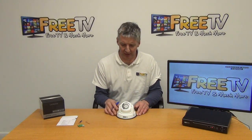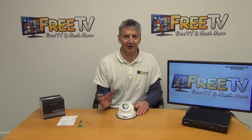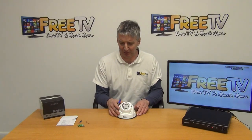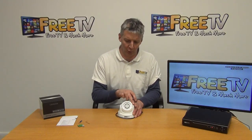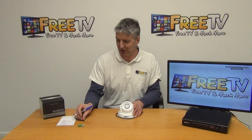This particular one here is impressive simply because the IR range is quite impressive, and the fact that it has good adjustability within the lens means we can adjust both the zoom to control the area we're looking at and the focus to bring that area back into focus. It's just possible to do so with this sort of micro screwdriver we have here.